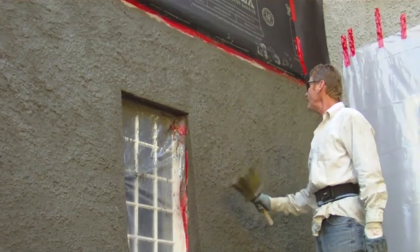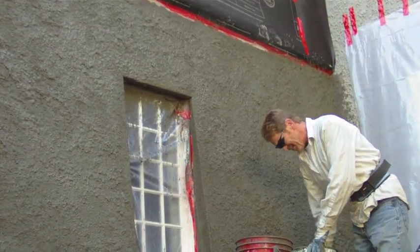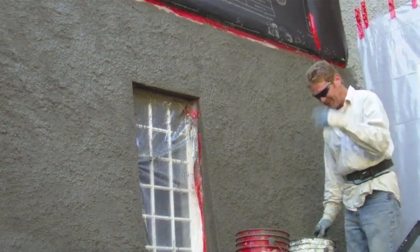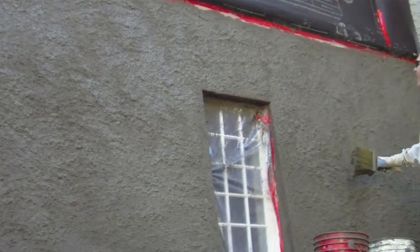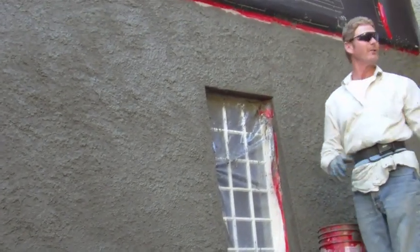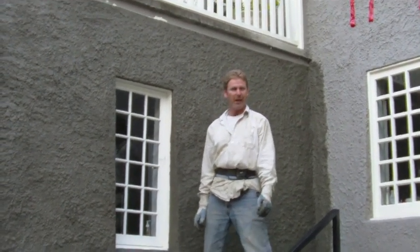I'm done with my first coat here. By the way, this isn't a job for anyone afraid to get dirty — you get filthy. I've been taking my glasses off every five minutes to clean them. Anyway, that's the first coat. I'm giving it about 15 minutes, hitting my low spots, and as soon as I get this wall true and plumb I'm going to put that next soupy coat on. The soupy coat will somewhat sag everything, and that's what they have here — it's more of a saggy look. We're almost there. Okay guys, we're complete with this tunnel dash finish. My son says I look like a raccoon, but it's honest dirt. We thank you folks for watching — we'll see you on the next one.